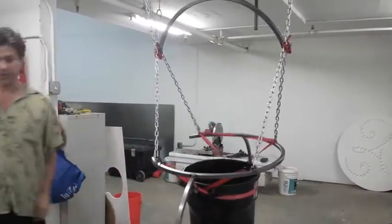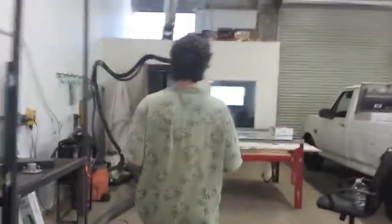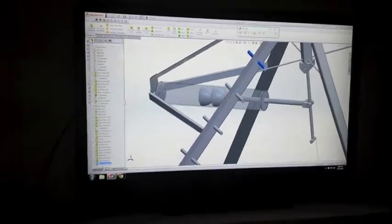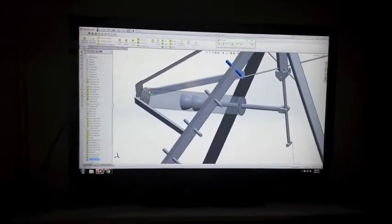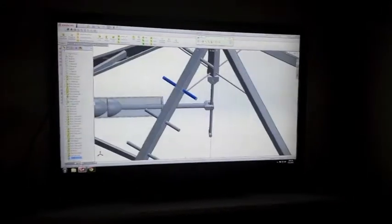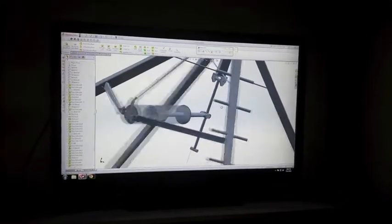But if you want to follow me in here, you can see the larger model that we're proposing that we build for about $40,000. I believe we could build a 40 kilowatt pumping station, either going directly to a plunger system or with electromechanical, the way we are in there. With the strictly mechanical system, this plunger system would have a set of check valves, very inexpensive. We have to charge a lot more for electromechanical because those motors aren't cheap, but this, however, is a much more cost-efficient design for just pumping water.